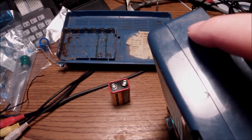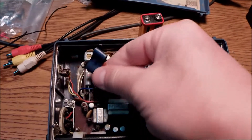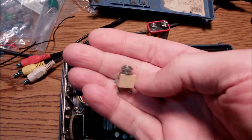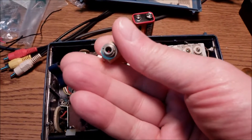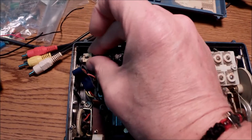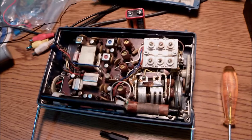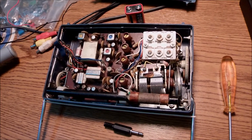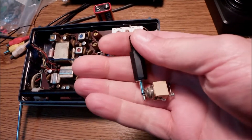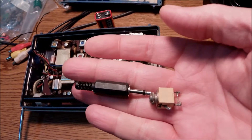You can place your external antenna right over here and get shortwave from very, very far distances. The idea is to go underneath the earphone jack and drill a little hole so I can get external power and remove the battery from inside the radio. For this particular mod we are going to be using this single jack — a mono jack, the male type — to get the power in.